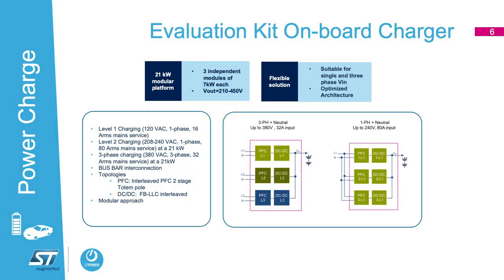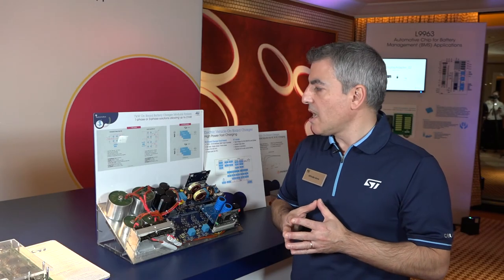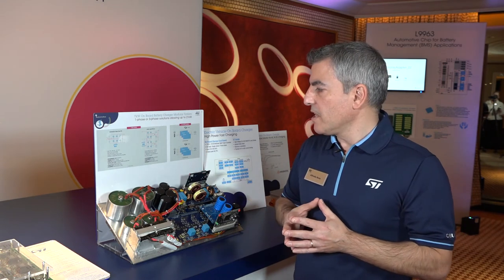We have different solution choices to make this happen in the on-board charger. We have chosen a totem pole PFC with silicon carbide MOSFETs in the PFC, so we don't need the external diode, as well as silicon carbide diodes at the output of the full bridge LLC for rectification. Another choice we made in this design is to replace two of the rectifiers with thyristors, so we can use the thyristors as a rectifier but also to control inrush current limiting, eliminating the external mechanical relay. All of these decisions allow us to use only standard SMD components for this seven-kilowatt on-board charger design.